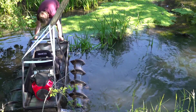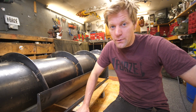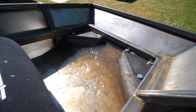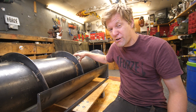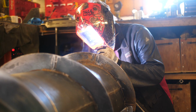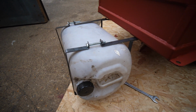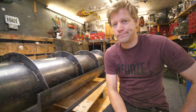Still, yeah, we've got a bit of water going in the drums. I can see the bubbles coming out the top. Well, it does float, it's just the weight distribution is still a little bit rearward and we've got a few leaks. So we've filled the tub up with water so we can see where the little pinholes are. We've welded them up. We've also given it a lick of paint. The screws, they got quite a bit of water in them. So we've gone around all the seams now, all the bolts, sealed them all up. So hopefully it's going to be a bit better. We've also added a little flotation buoyancy adaptation to the back just to try and lift it up a little bit and try and get it a little bit more level.